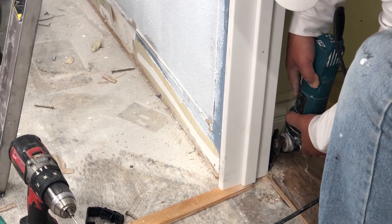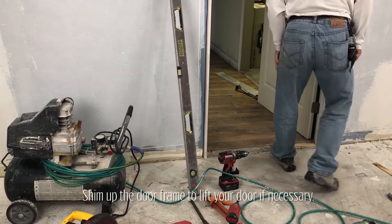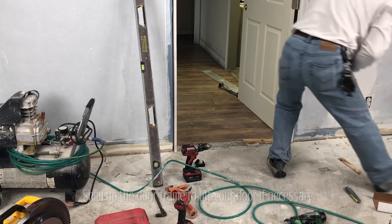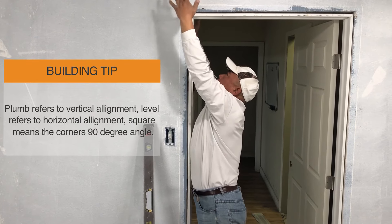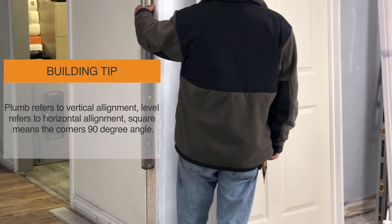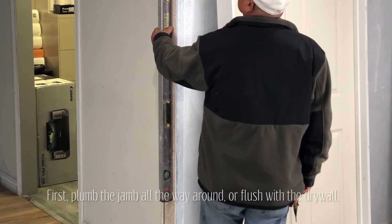You can also use a multi-purpose tool to ensure there are no impediments to the door frame. We now adjust our low-hanging door by shimming our door jambs up by a quarter inch. Do not overthink this — when hanging a pre-hung door, always start by leveling and plumbing the hinge side first and go from there.